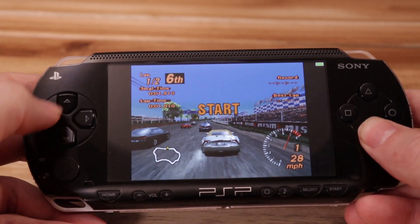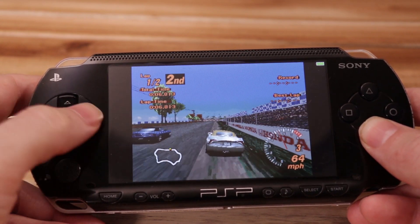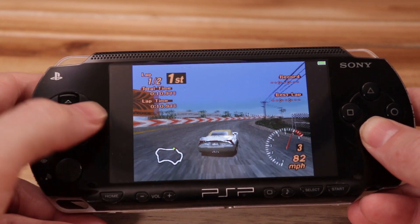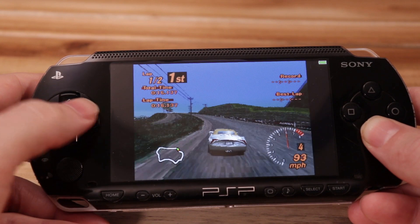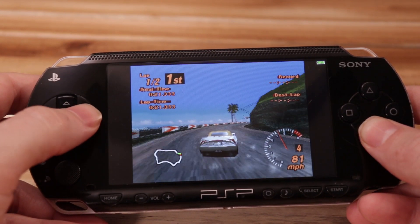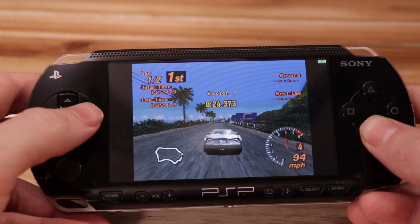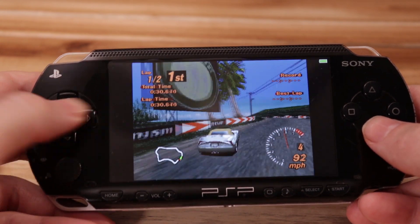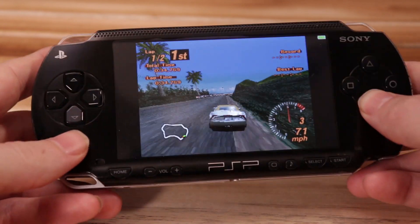The only actual feature I haven't made a decision on is between the audio and the display quality. Right now I'm running the board in full 24-bit DPI mode, so you're getting the best color quality possible, and I'm running the audio in mono, because there's only enough pins to have one or the other. So there is the option to run stereo, but it means running the display at 23-bit instead of 24-bit, because the pin has to come from somewhere. So instead of having 8 bits of color each for red, blue, and green, it would be 8 bits for red, 7 bits for green, and 8 bits for blue — so you'd lose a small amount of color depth in the green.